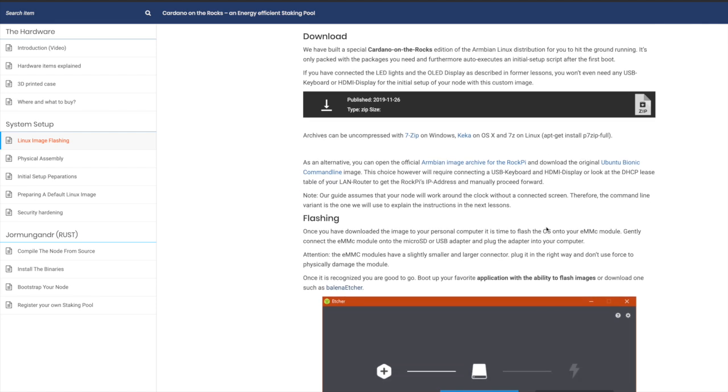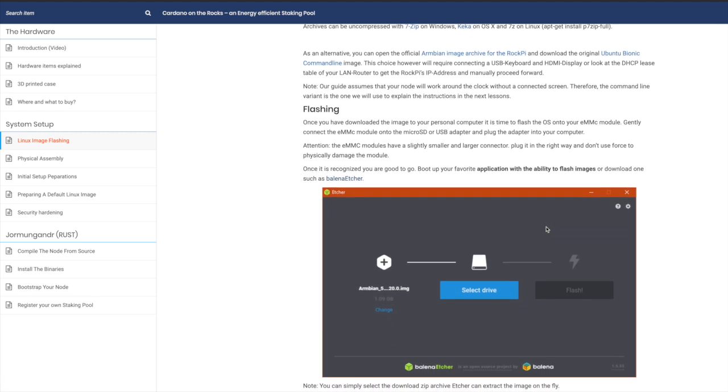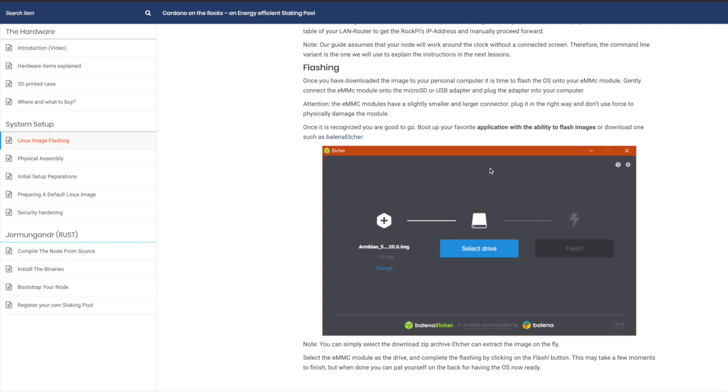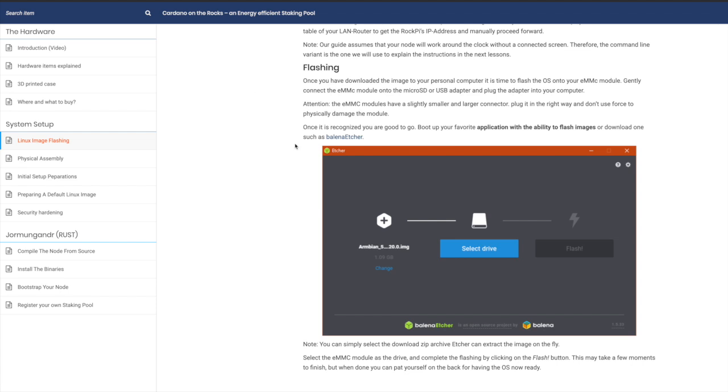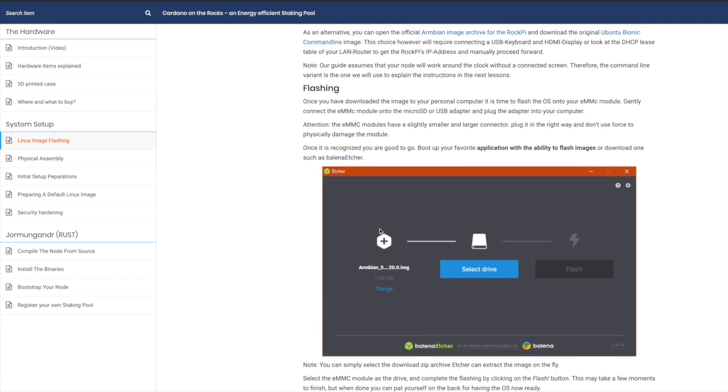And the software that I would recommend using to flash the eMMC module is going to be Balena Etcher. Balena Etcher is very easy to use. It's seamless. I'm going to link to that in the description as well. The link is also on the web page. So once you've downloaded Balena Etcher for your particular operating system, open up the program, and it's going to give you the option to select the image that you're going to be flashing. In this case, it's going to be the image that we had downloaded.